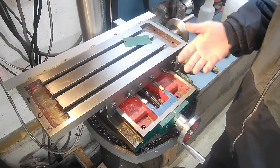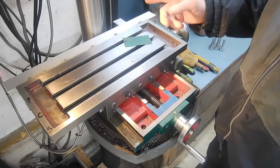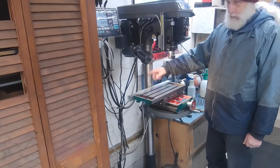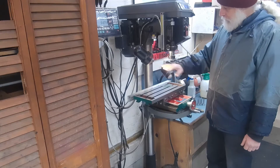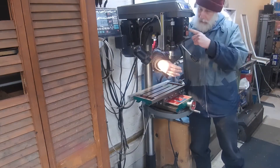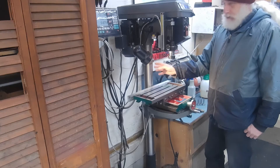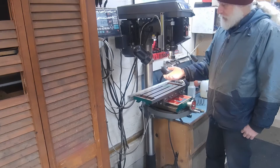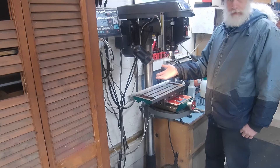That being said, I can easily hit 0.01 millimeter with this and be confident it's going to stay where I put it — the movement is smooth, not jerky. But on any drill press setup, there's some flex in the column. For a mill you're putting lateral force along the X axis, and what it does is it wants to twist the head as you push on the work. So during a heavy cutting operation it may twist a little bit; for light work it's usually not an issue, but if you start getting into bigger cutters you will notice it.